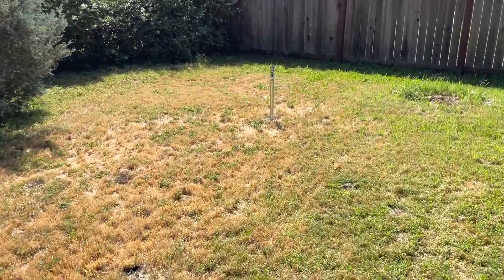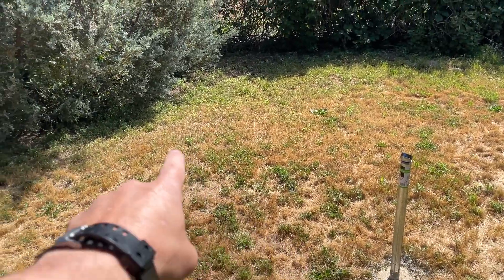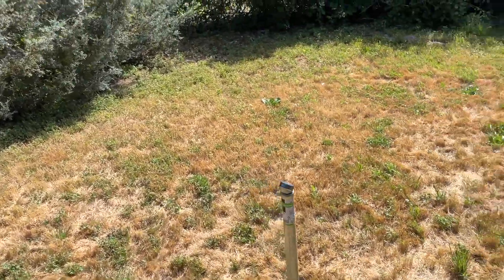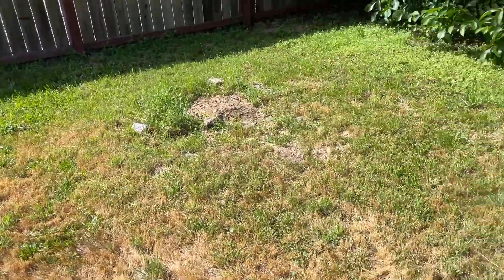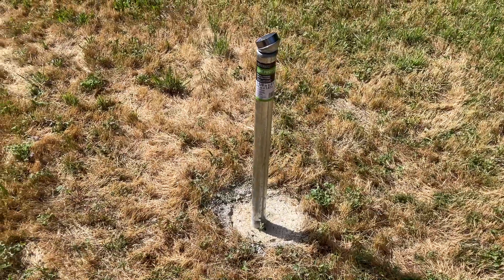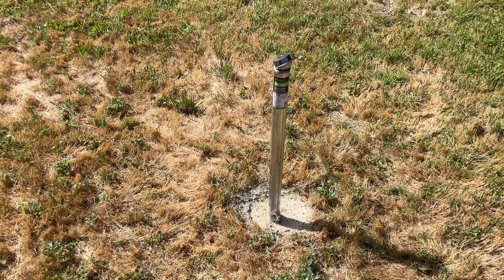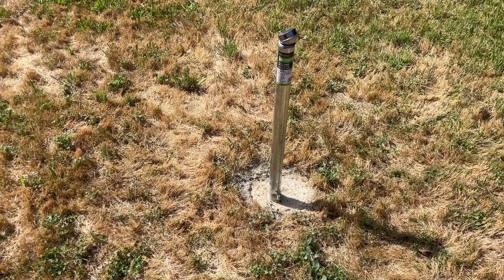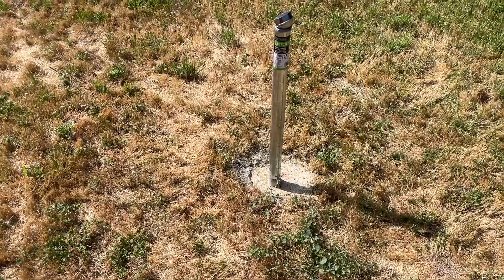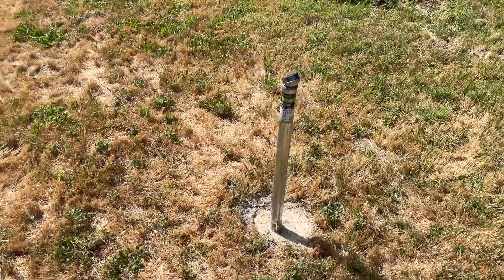This is the area where it's gonna go. There's the mounting pole I put into the ground. The eight-foot radials are gonna go basically there because of that tree, and the rest I can do 12 to 14 feet all the way around. It's a six-foot fence post — I dug down 24 inches and drove the pole two feet into the dirt, so I've got about two feet sticking out. That's where the antenna is gonna mount.